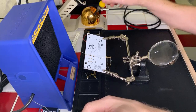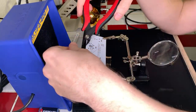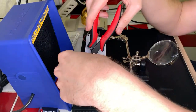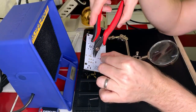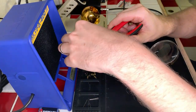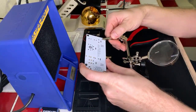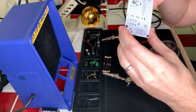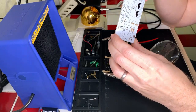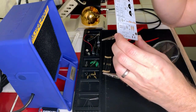Okay. First batch of resistors on. Let's go ahead and snap all the leads off with our flush cutters. Slightly awkward ones under here. There we go. Okay, great. So that's our first set of resistors all done. And let's just double check the work here. Looks good on all ends. It went through pretty heavy. Maybe I shouldn't have been feeding as much, but the 10K resistors are all in there and happy. We can probably lift a little bit off of the board if we wanted to, but I'm not going to worry about it. So now we're going to put in the 470 ohm resistors,